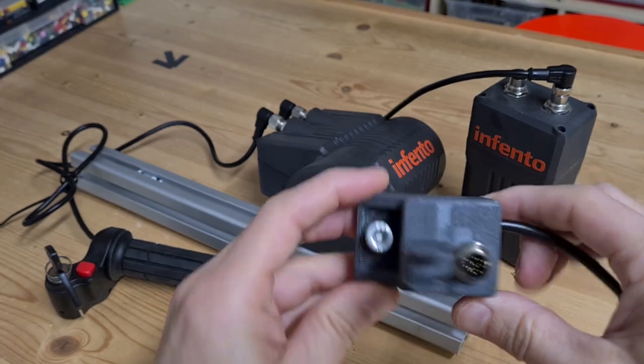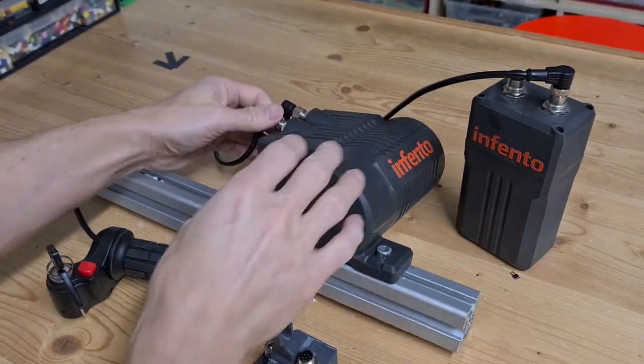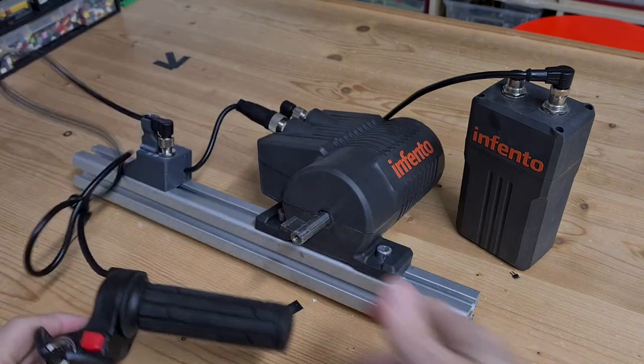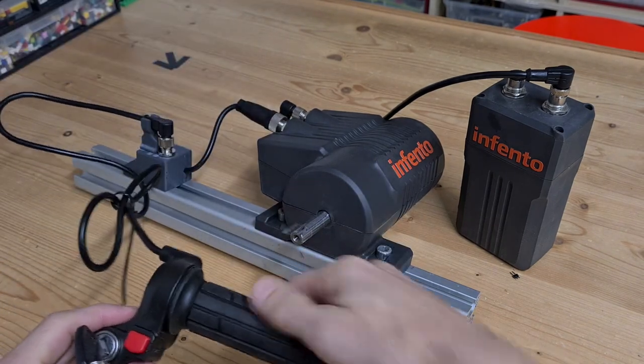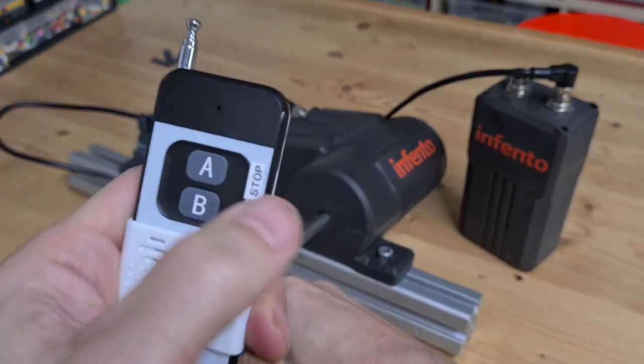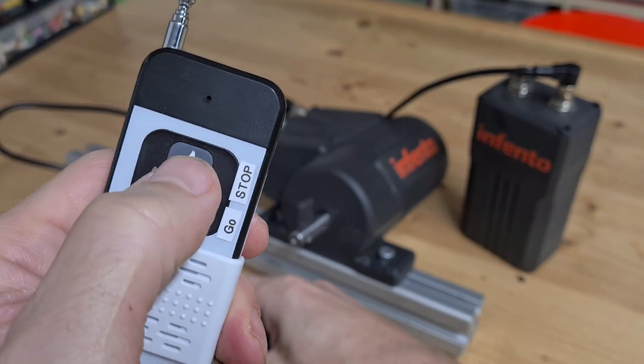The grey box is connected plug and play between the motor and the throttle cable, and it requires no extra battery. When the motor is powered on, the throttle is in the kill state by default, so the kit can't override the kill function while switching the motor off and on again.